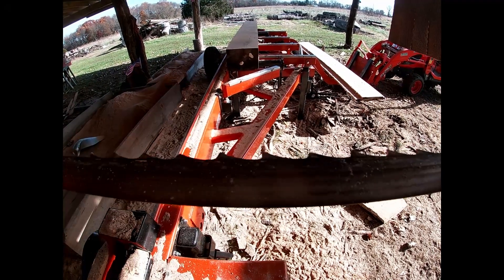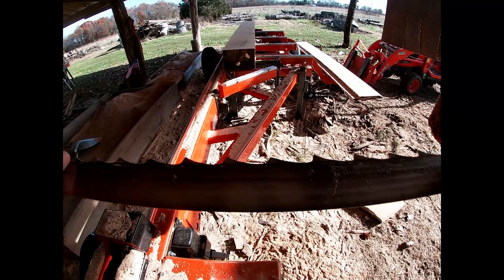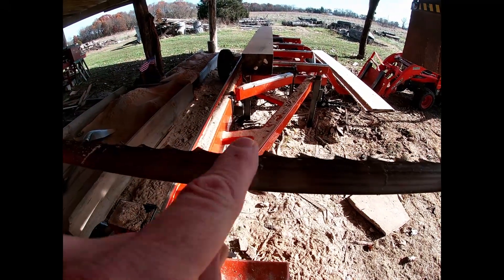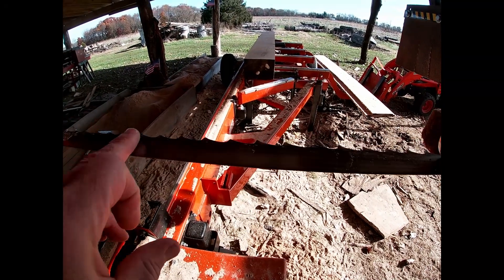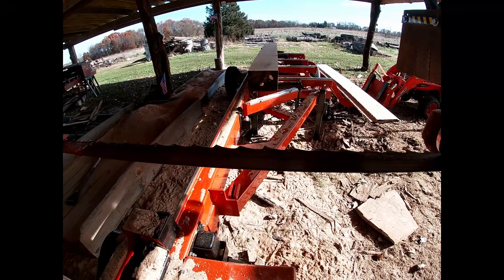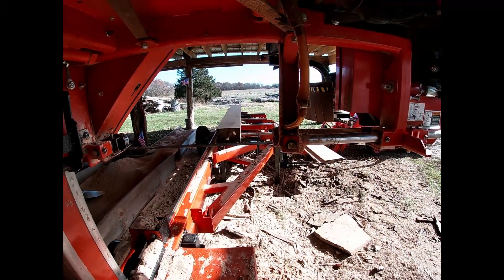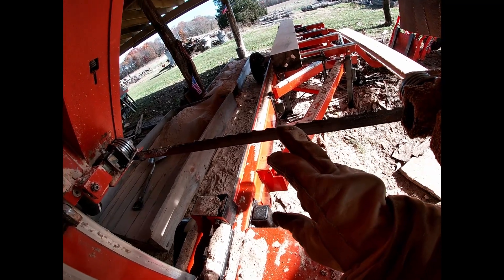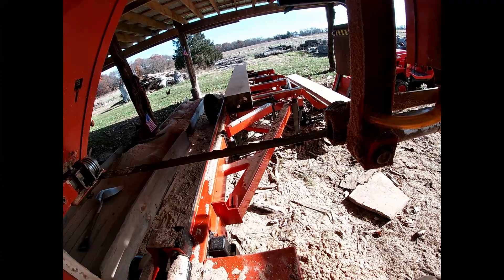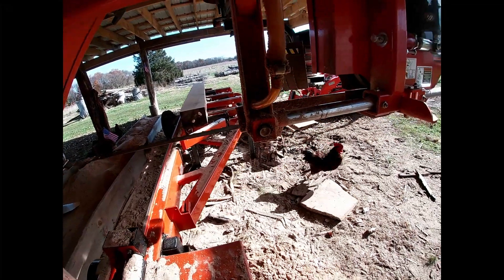I'm betting I can wipe that off with my finger. All but the very last of it comes off - there's just that very little bit chunked on the teeth. That's how you know if your water, diesel drip, or whatever you're using is cleaning your blade - it should just come right off. There should be no buildup on this blade or on the bottom sides.